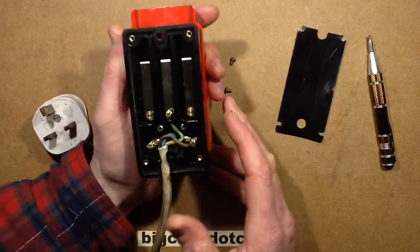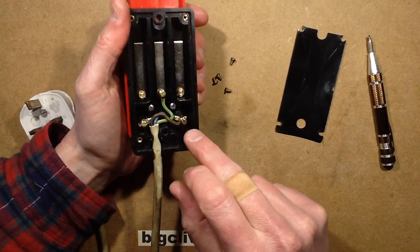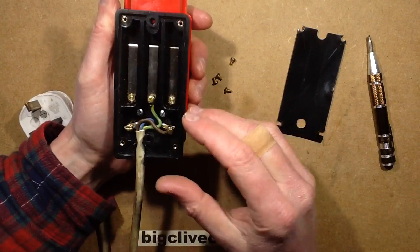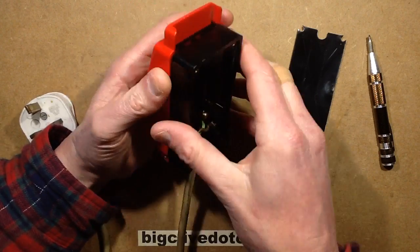Make sure it's unplugged. The connection comes in through the strain relief - it's just a press-in strain relief. It's got the screws for the earth in the middle that are continuously connected to the output terminal, and the live and neutral which are connected through the knife switch. And cobwebs as well - this is quite an old one.